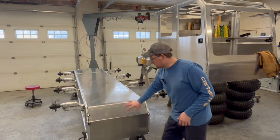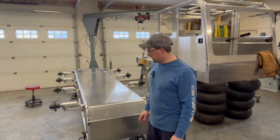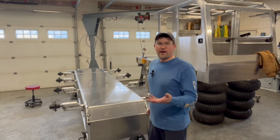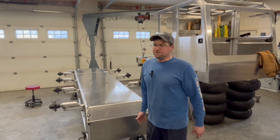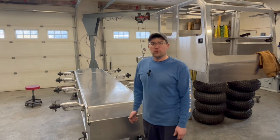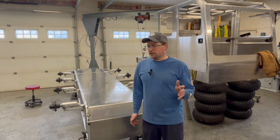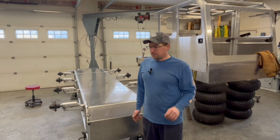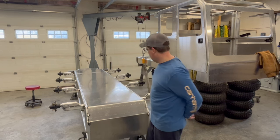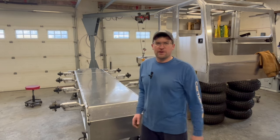And we got the 3/16 belly pan on, a little bit of welding left to do in some of these off angle areas. I'm just going to wait till we have it on its side, get in there on a better angle. When you're spool gunning aluminum, although I can do overhead and vertical with it, it tends to go through a lot more tips. That spray transfer welding that you're doing with the spool gun tends to fall back onto the tip itself and mess it up. But anyways, flat horizontal is just going to give me a better quality weld.